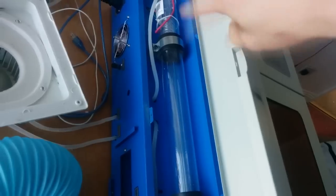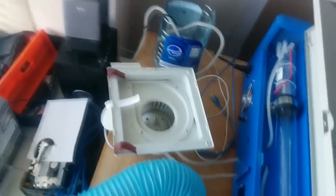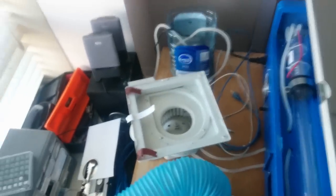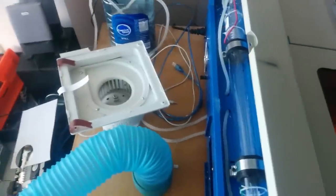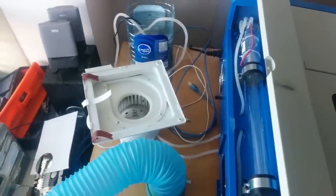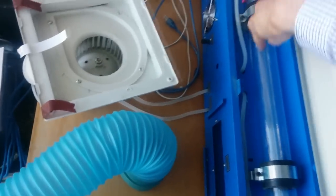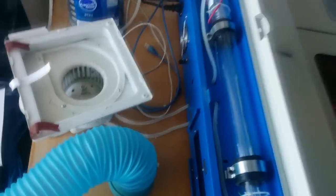You can see it has a hose coming in the far end and one coming out the near end. All of that is wired back to that aquarium pump there, just thrown into like two liters of water or so. You just plug in the aquarium pump and away it goes. The water actually goes through the inside of the tube and then back out - so it cools it that way.